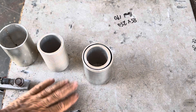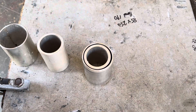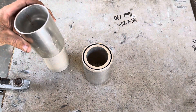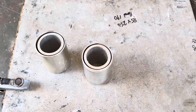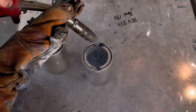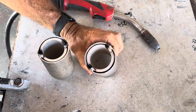I've set my aluminium panel up on the bench and I've got the earth connected to it, so I don't need to earth the individual pieces — the earth will go through the aluminium. You can see that we've just lined that up nicely; close enough is good enough. We'll do the same with this one — sit that over the top there and just get that gap looking pretty nice. We'll tack them into position. They're all tacked in nice, looks pretty even to me.